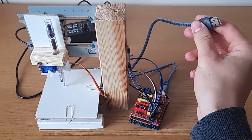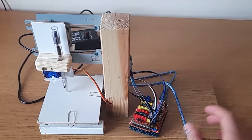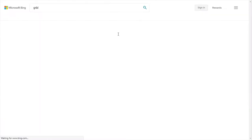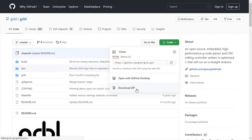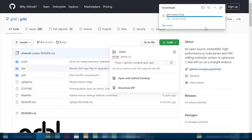What you need to do is plug this into your computer and let's download and run some programs. In order to get our plotter working, we're going to need some code, obviously. So the first thing we're going to need is GRBL. You can find that from GitHub. I'll put the links to everything in the description. All you need to do is download this code as a zip file and just save it somewhere.